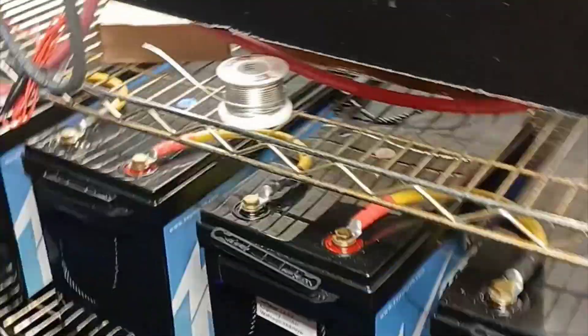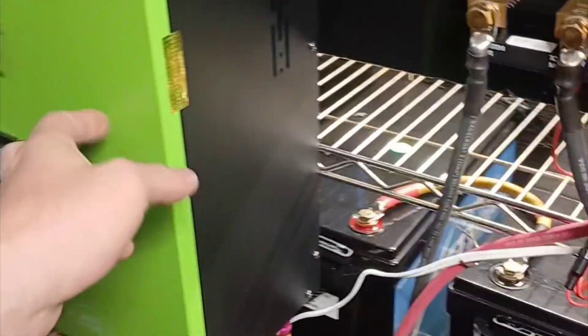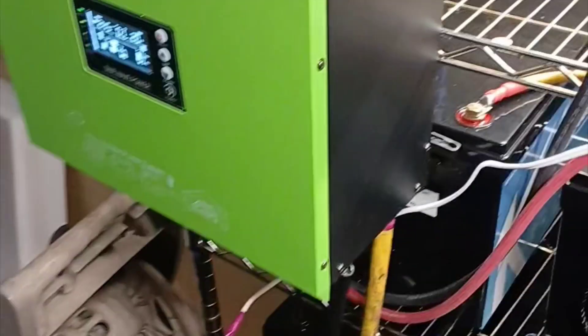The system has been operational for a few days now. The last of the eight batteries arrived today. I have a set of four in series putting out 48 volts, and another set of four with the last two batteries still balancing. I've had it running the lights in here for about a week — it's been okay. I had a little issue with the smart shunt and had to learn the settings. Next I'm adding a 100-amp charger, because this only puts out 15 amps on AC power.